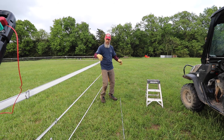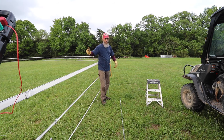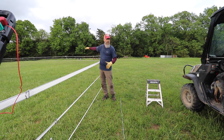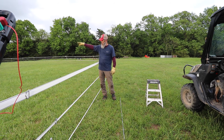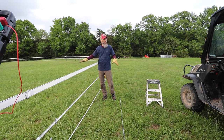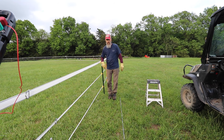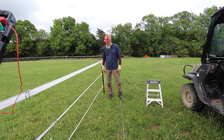So these rods spaced out 10 feet apart has more kind of area for that distance out there. If they touch it way over there, then the current has to go through the ground from that distance way over there and reach these rods. So the ground being wet like it is, probably, the better it's gonna be. But if it was like super dry and sandy, then you definitely need three rods. But this, I'm hoping that, and deep. I've already got these 6 feet into the ground. That hopefully will be enough, we'll see.